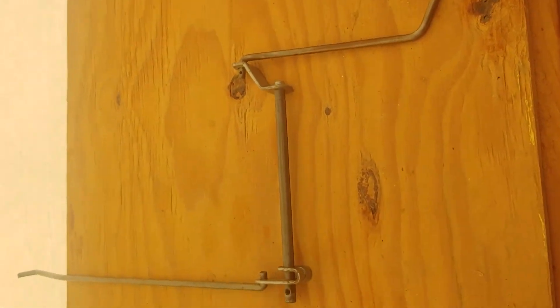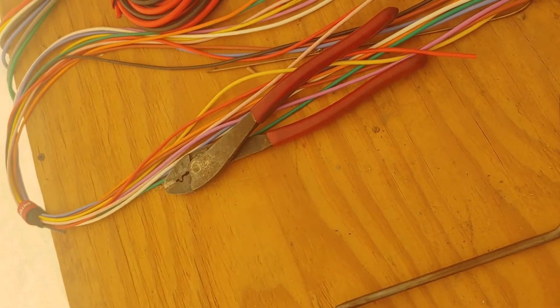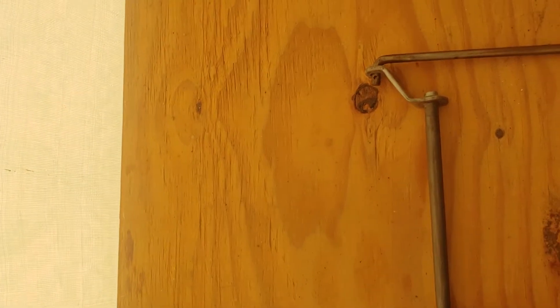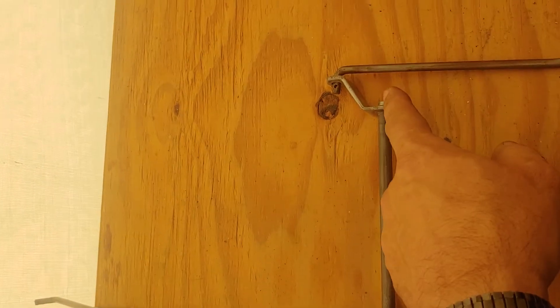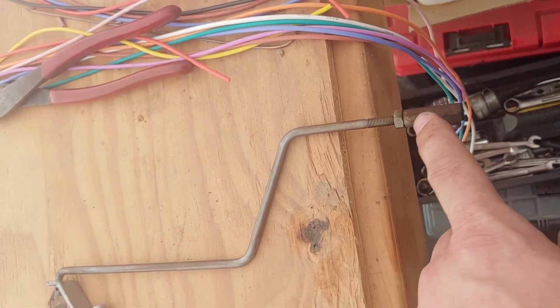Here's the old throttle link. As you come out of the tractor, there's a little bit of wear at these connection points and the pivots. This is coming from the throttle handle down to the crossover shaft that goes through the battery tray and then from there to the injection pump.